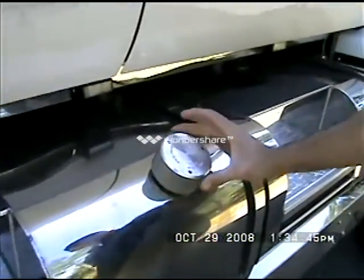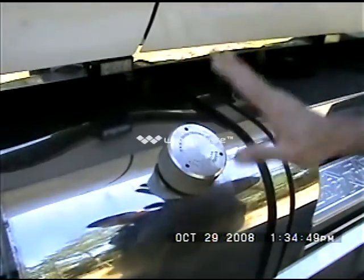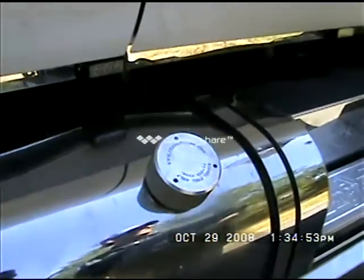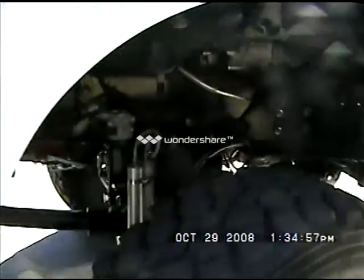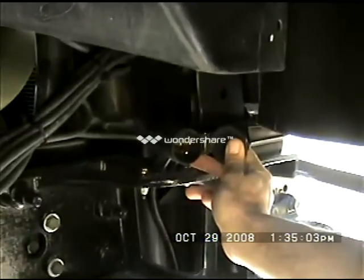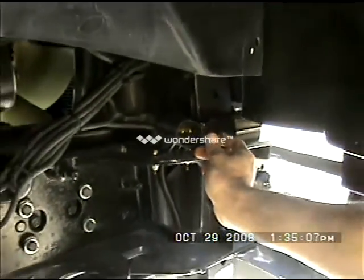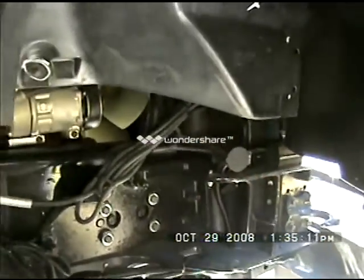This is your other side diesel fuel tank — this one and the other front one are diesel only for the engine. Under this fender well you'll find a 110 male outlet. This is for your engine heater, keeping the motor warm if it's very cold where you're at. All you want to do is plug an extension cord in here and plug it into the wall when you park it at night.